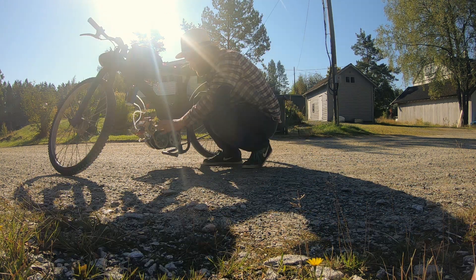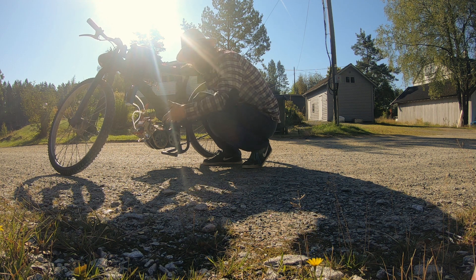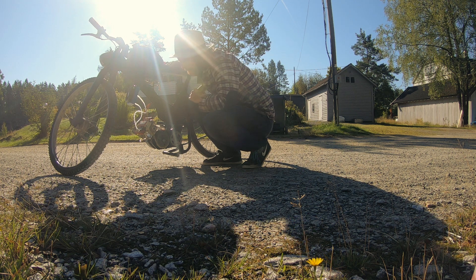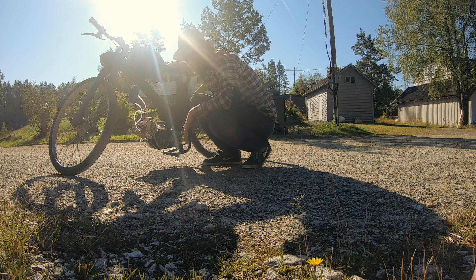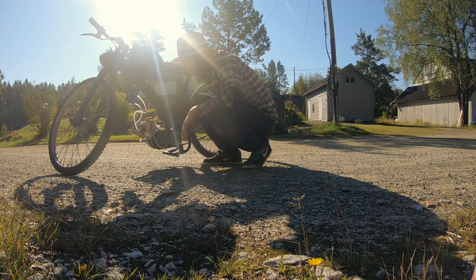I was becoming optimistic — it was pulling its own weight including me, and first gear even locked up, so it was rideable. But the other end of the crankshaft is not turning. I snapped the crank. Many people warned me. This crank is just end-supported, so that's how it goes. Short-lived fun. Cool engines — maybe not for mounting in mopeds. See you next time.